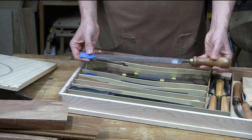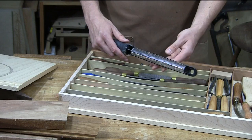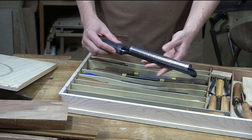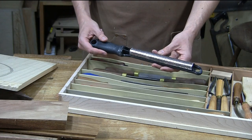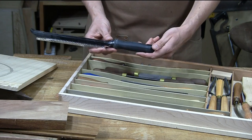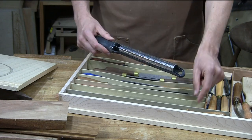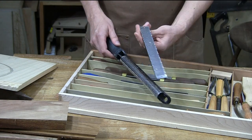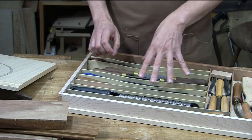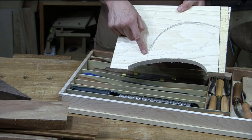One of the more modern tools — this is called a microplane rasp. These are just little tiny plane teeth made of hardened steel. I picked this thing up at Woodcraft probably 10, 12 years ago. These are really cool, they shape really, really fast. It's got this curved blade — you can pop it out and put a flat blade in. I keep it around because it is a really beneficial tool for removing a lot of wood. But if I wanted to shape a curve like this, it makes more sense to saw it out than tackle it all with a rasp.